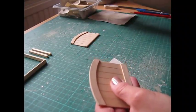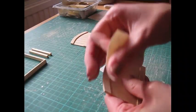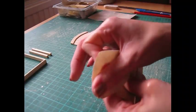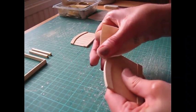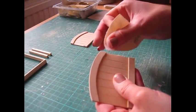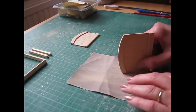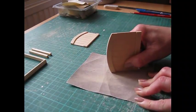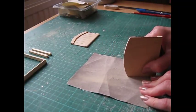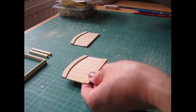Swap for a slightly smoother paper - I'm going to use a 500 here - and we just want to round over this top edge. Go along sweeping the paper from front to back, so that we haven't got a sharp edge along that top curve. You can also place a piece of sandpaper on your worktop and sweep the piece across in one direction so we don't curve the edges - this will make sure that the mouldings are flush at either side for when we attach the legs. Do that on the other side as well.